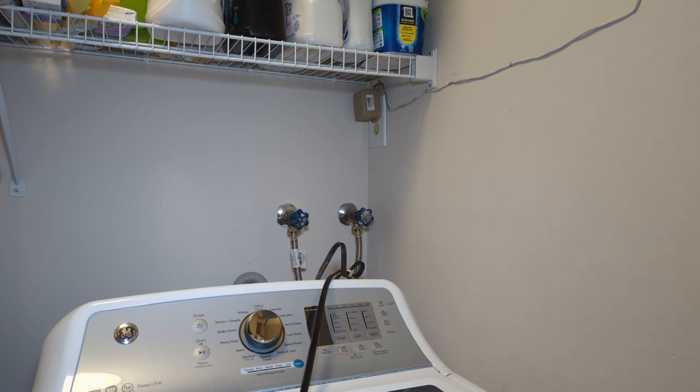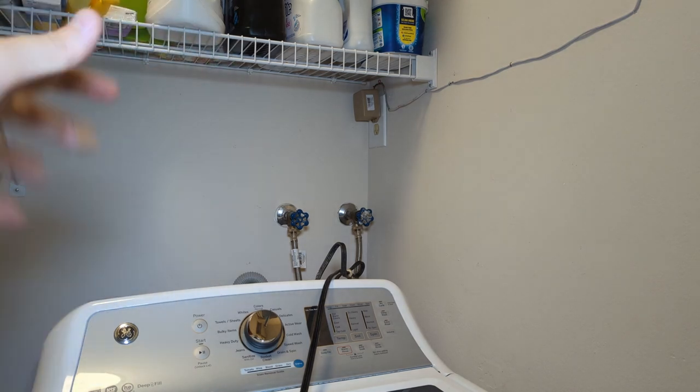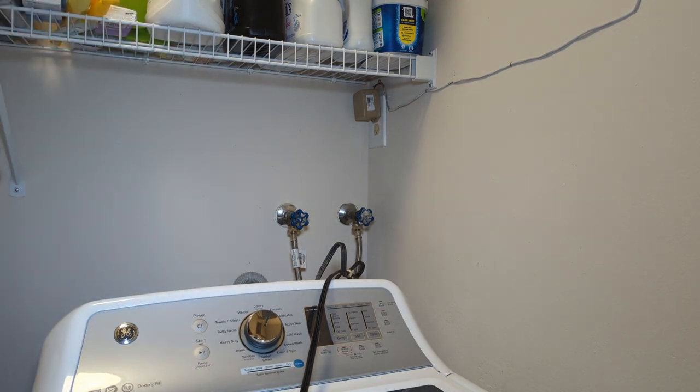I've already shut the water off to the house. One little tip, if your shutoff valve outside is one of those gate valves that you have to turn 1,000 times and doesn't shut off all the way, just open a hose bib nearby and it'll let any water that leaks by the valve out the hose bib so it doesn't mess with your soldering here.